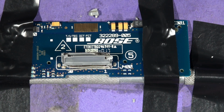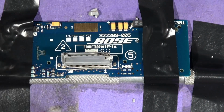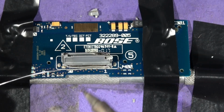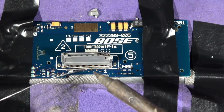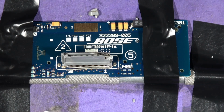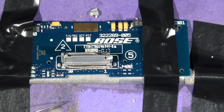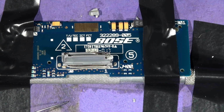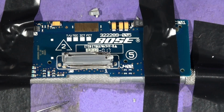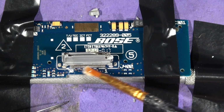Now, I would normally use a hot air gun for this part of the process, but as I'm showing you how to do it with the soldering iron, I'm going to put my money where my mouth is and try and make this work. So the idea is to use that copper wire as a bus bar to melt all those connections, okay? So the first thing you want to do really is to prevent any sludging up of the solder into a horrible pasty solder. Rather than nice liquid solder, we end up with an oxidized sludge of solder, which is not what we want.